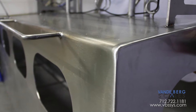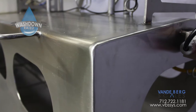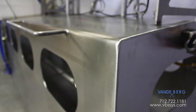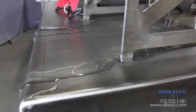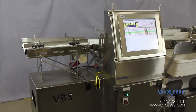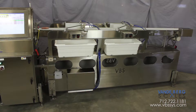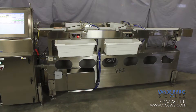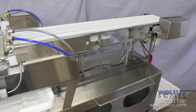Our design incorporates a wash-down-friendly 304 stainless steel construction, which features rounded corners, continuous welds, and an overall construction that easily sheds water. The scale portion is fabricated from 3/16-inch stainless plate, while the sortation system is fabricated from 1/8-inch stainless plate. This plate design significantly increases rigidity versus stainless angle construction. The welds are ground and polished to minimize crevices for bacteria formation.